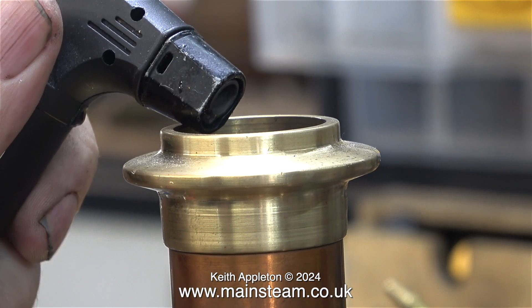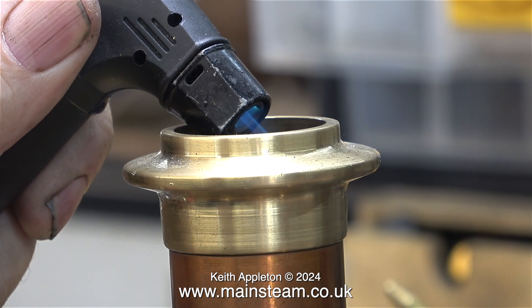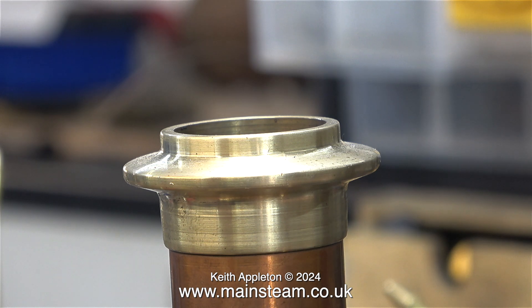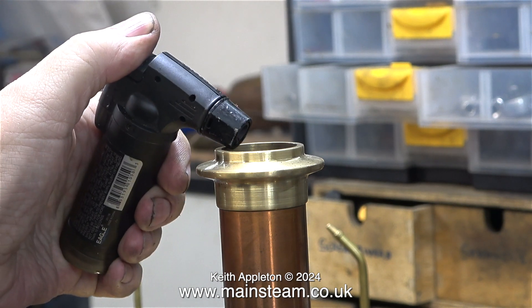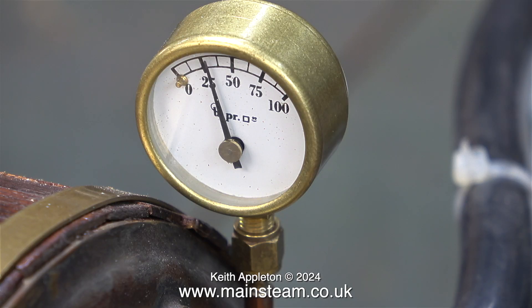Using a naked flame at the chimney I light the gas initially. It takes a while for the gas to come through because the silicone rubber tubing is full of air. I check whether there's a flame at the top of the chimney — there isn't; in fact the small flame on the blowtorch went out with the products of combustion. Using butane, the pressure soon started to rise.